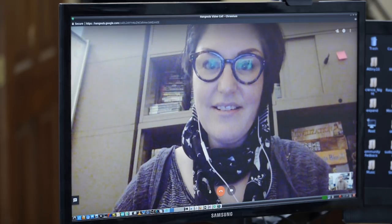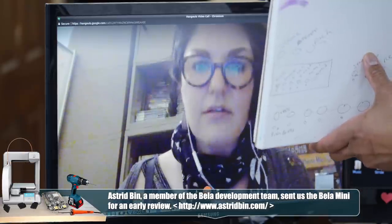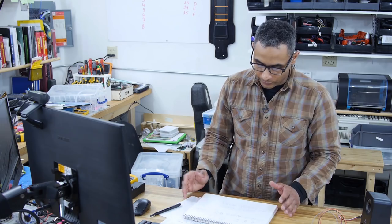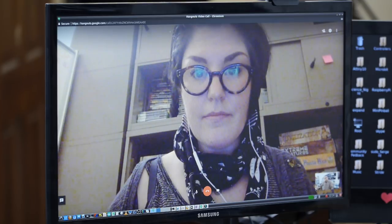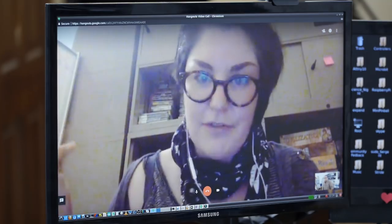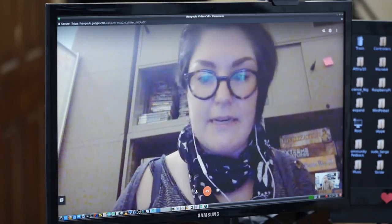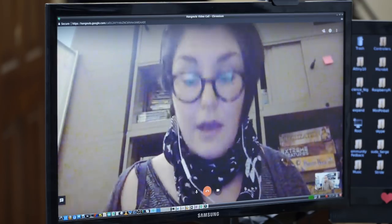We have Astrid, one of the developers of the Bella and the Bella Mini. I did a little sketch — I'm basically thinking a 16-step drum machine with volume, tempo, and pitch, plus kick, snare, hi-hat, crash, tom 1, tom 2, and a bank selector. That's going to be quite a bit of I/O. The Bella has 16 digital I/O. Are you looking at add-ons like a digital I/O expander? For digital I/O you can always use a multiplexer, like a shift register. With the original board, we have an analog I/O expander multiplexer capelet which expands your eight 16-bit analog I/O into 64.